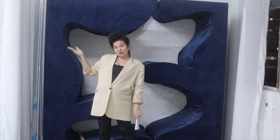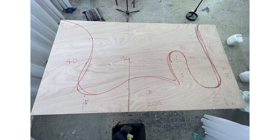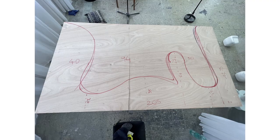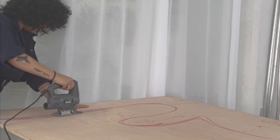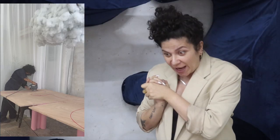What I did for the first couch, the one on the right, was making a base of 1.15 meters. Instead, the second curve, the one where we have the first sitting, is gonna be only 79 centimeters. And the top part, that is the thickest of all, follows the same exact size as the bottom, so we're gonna have again 1.15 meters. Once you have everything nicely measured, you are gonna literally take out your jigsaw and simply cut out all the zigzag that you need for this shape, and then we're gonna double it. So you don't need to calculate it again. I would just place the wood on top of the second plywood and cut it all out, and finally you have the first structure to build the inside.